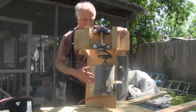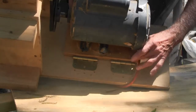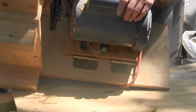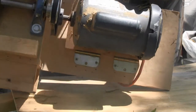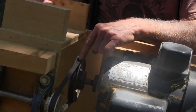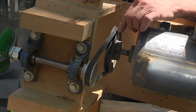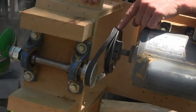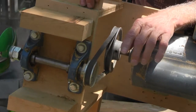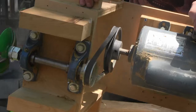The first thing I want to talk about is the motor. I've taken a short piece of plywood, mounted the motor on it, and used a couple of four-inch door hinges. At the top, this screw is the adjustment so you can control the belt tension from the motor to the shaft pulley. I have a five-inch pulley on the motor and a two-and-a-half-inch pulley on the shaft — that's a two-to-one ratio, so the motor turns at 3,450 RPM and the cutter turns around 7,000 RPM.